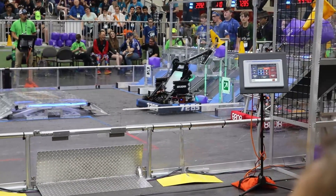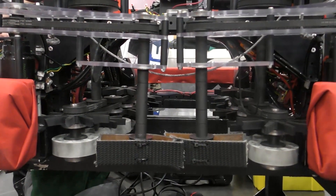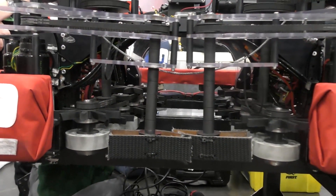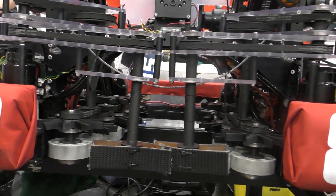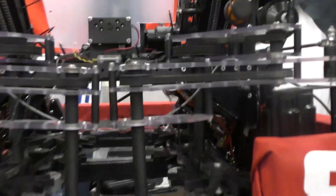We use material guides in the tunnel to make sure the position is right going to the gripper. The biggest advantage of our intake is that we can handle game pieces in any orientation — so the tunnel corrects it regardless of how the cone or cube enters.